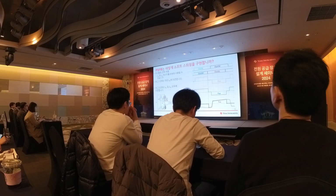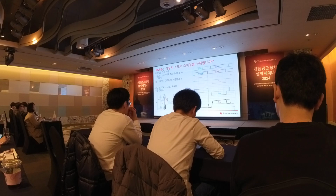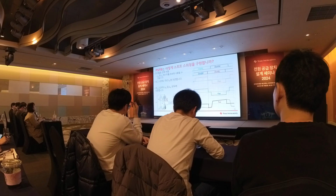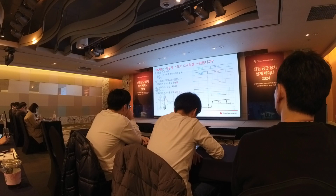At the other switching transition, as you can see on the waveform, the current is basically the output current plus the output inductor current ripple. So we have more energy during this transition to charge and discharge the COSS. So it's easy to lose ZVS at leg one, while it's easy to maintain ZVS at leg two, because naturally the current and the switching transition between these two legs are different.